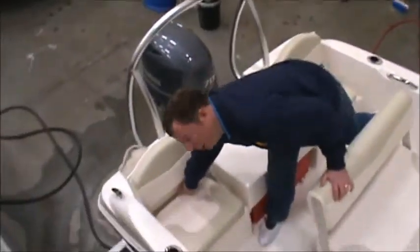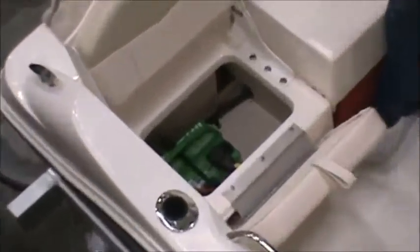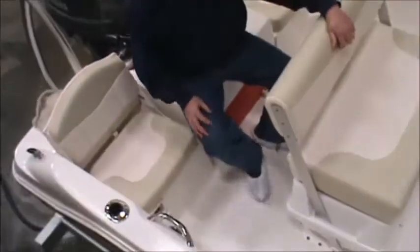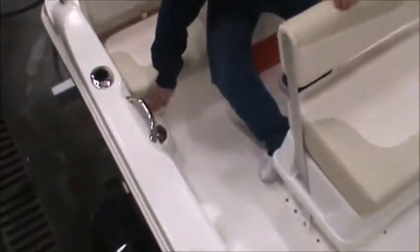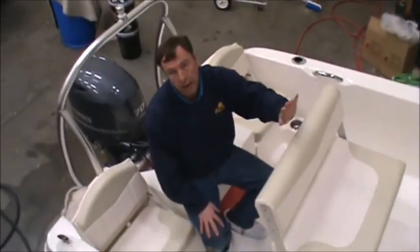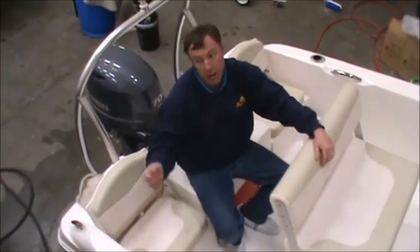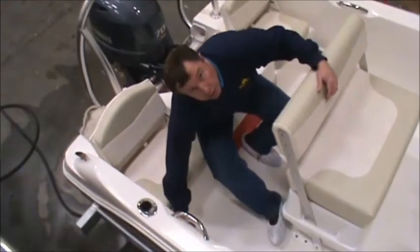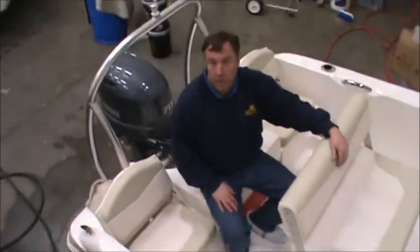On this side is your battery access underneath the seat, so you've got a fresh Interstate battery in there. On the forward side of this same panel there's a red rotary switch right here in the corner. When it's pointing straight up, that shuts your battery off so none of your accessories will function — you don't have to worry about leaving a light on. Just make sure that switch is turned to the off position. When you're ready to use the boat, switch it to the 3 o'clock position and that will allow you to energize everything on board.